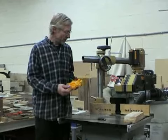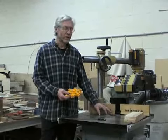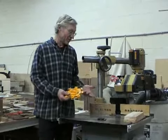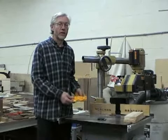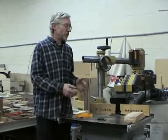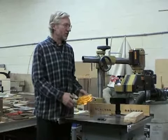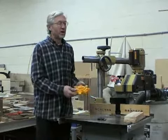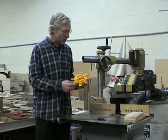What I've set up on my shaper table here is a reversible glue joint. It's one of the more difficult bits to set up because it involves a lot of trial and error. When you have two pieces of stock that you want to join and come out flush, this jig is a nice advantage for that.